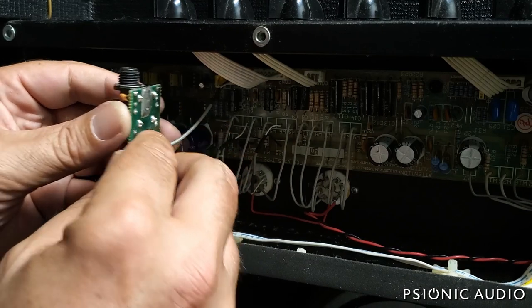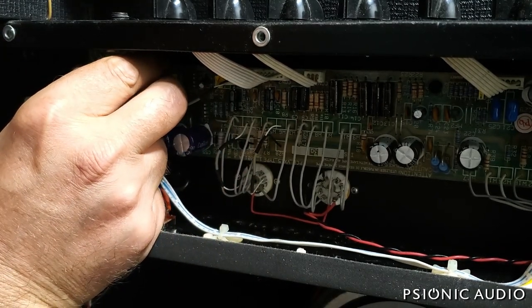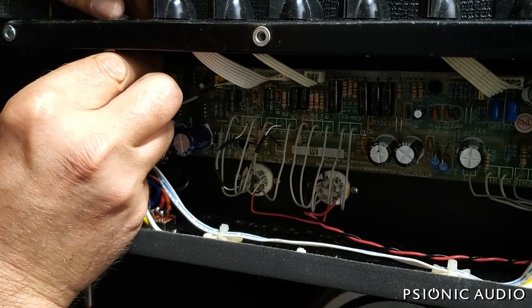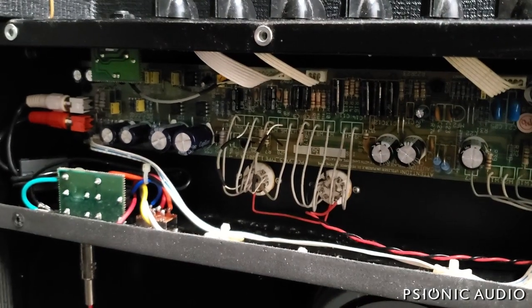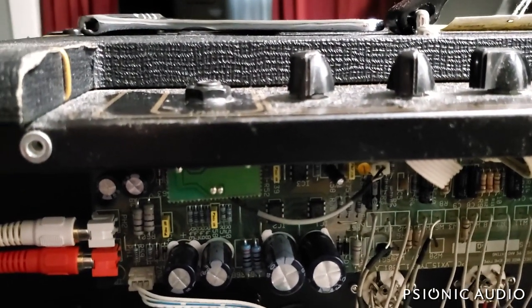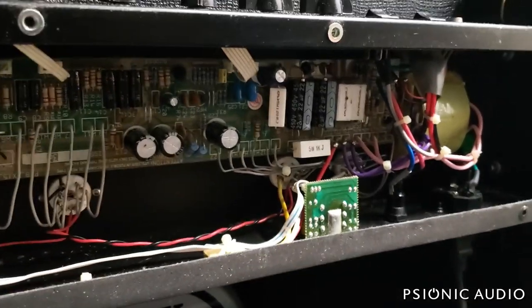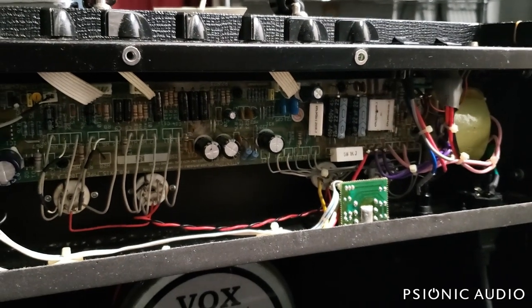This one doesn't have a compression washer. It's supposed to make flush contact with the metal of the chassis, and it's not, which is going to cause all kinds of noise problems once the diode issue is fixed. The threads are semi-damaged — I suspect the nut was put on at an angle and forced. Let me line it up properly, parallel to the surface of the top panel, and see if it'll tighten. It was partially cross-threaded at an angle and not going flush. I'll have to remove it and clean all those metal surfaces before I can call this amp done.